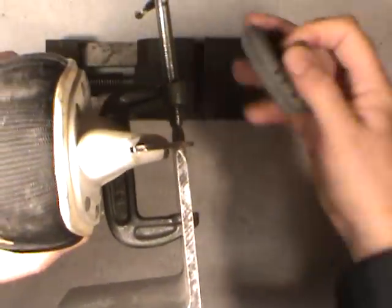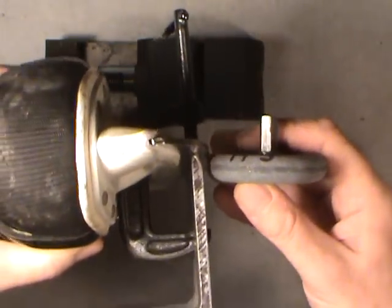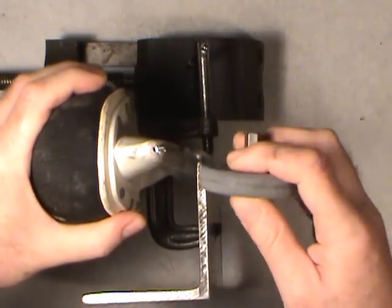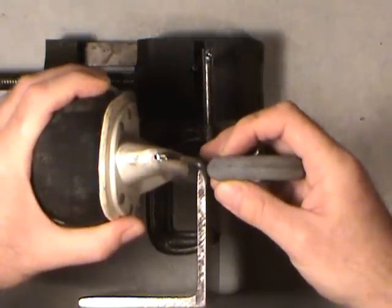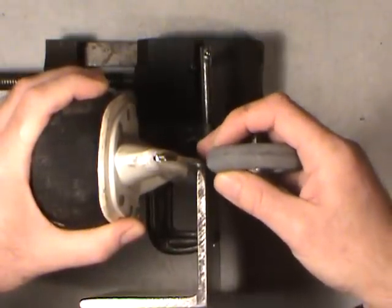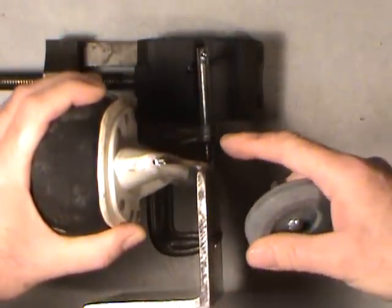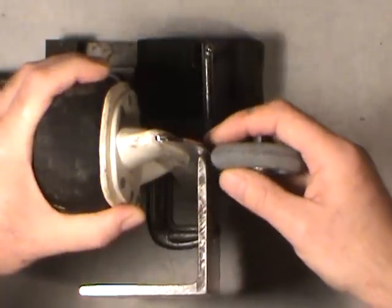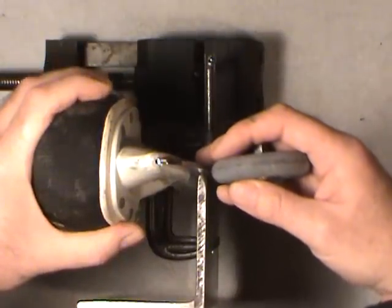And then the grindstone, I'll just show you here quickly. I'll give you both views, from the side as well as the top. But this is spinning in the drill press here. Let's see if I can get that to stabilize for me. So anyways, this is spinning well over 1,000 RPM, and it's got to be on center of the blade. The radius on the grinding wheel has to be exactly in the middle, otherwise you're going to have one edge that's low and one edge that's high, so you've got to make this adjustment here and lock it in on the drill press. This is fixed, the table's clamped into position, and I keep the quill, or the spindle, as short as possible to keep the vibration down. More rigidity is better. Once the table height is fixed, I'll keep the spindle as short as possible for rigidity, and then I'll center that up.